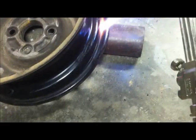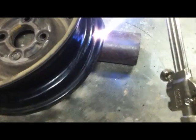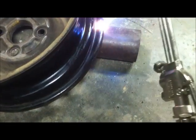Okay, so now I'm just gonna heat that area right there because I tried beating on it a little bit and it didn't work. I don't want to apply any oxygen. If you're not sure how to use a torch but you have a set, I do have a video on how to use them and how to set that tip — you can watch that. So I'm not gonna apply any oxygen; I'm just gonna use the acetylene only and just heat it up a little bit and then smack it down with a hammer.